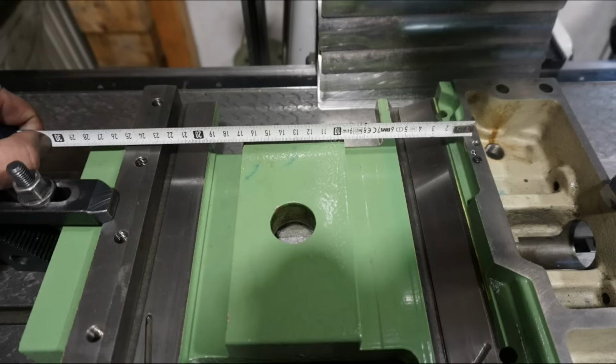But then I realized that I made a mistake by blue transferring that hole location, because that set me off maybe 0.5 millimeter up to 1 millimeter from the location that I implemented by pre-drilling that deep hole here. By following the bluing method, I put myself off of the axis of the deep hole, and the deep hole was very exact. And after I realized this, I decided to drill that hole a bit larger. So this is, I think, 3.2 millimeters in diameter, as opposed to 2 millimeters, and that helped breaking through to the EDM deep hole. And you can imagine how relieved I was.